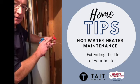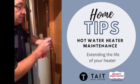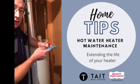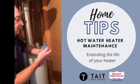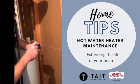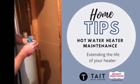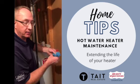So in the long run, I'm better off having this ball valve in here. This is a bit of a caution for you though: sometimes these old valves don't come out that easily. This one just unscrewed — I put a pipe wrench on it and it twisted right out. But these do get brittle and sometimes they can crack inside there. So this isn't really a job for somebody who doesn't think they can take that on, because I would have literally had to go in there with a little chisel or screwdriver and chisel out the remainder of the threaded piece. Luckily for me it did come out, but it's something to caution you. It seems pretty straightforward, but if this breaks inside there, it can be a bit more of a problem.